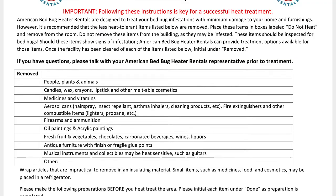First thing I look at when I come into a room is where the closet doors are and which way they're hanging. The whole trick with heat treatment is to keep constant airflow in a nice tight circle. So if you've got a door that opens one way or another, it may affect that circle. In this room these doors are not really going to be an issue, so I'm just going to set this up in a clockwise fashion — shooting to the wall, to the window, over to this area, and then right back to the heater.